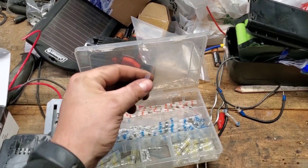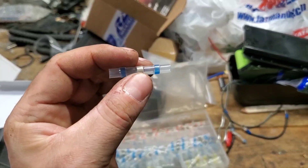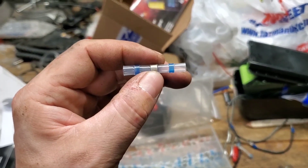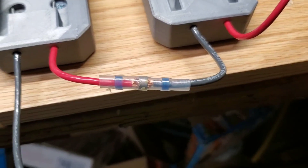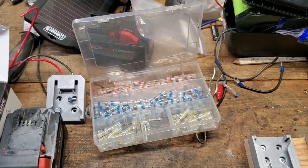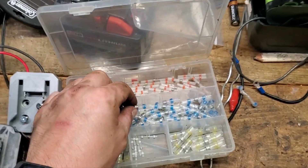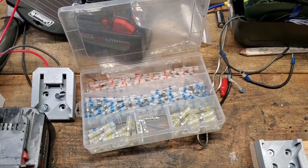Here's what we're going to use to solder this together — quick connect solder fittings. It's basically a piece of shrink tubing. The blue bands shrink tight along with the rest of the vinyl material, and in the middle there's some low-temp solder. You strip the ends of your wire, stick them both in the middle, heat it up with a heat gun, and the solder melts and bonds them together. I've got mine mocked up here — I snipped the ends of the wire and flared them out a bit so they intertwine when inserted, giving you a better solder joint. I got this kit about five years ago. I saw it on Facebook and was a little skeptical — looked too good to be true — but for about 15 bucks, why not? These have been great. It comes with all different sizes depending on what wire you're connecting. They make a good tight fit, real strong. I haven't had any failures with them — pretty good investment.